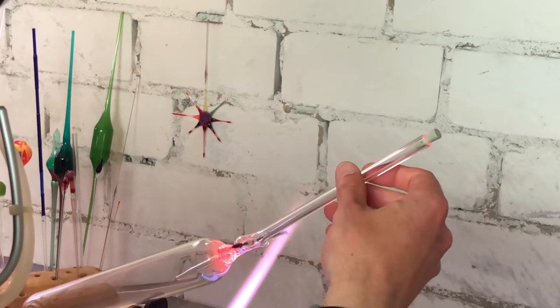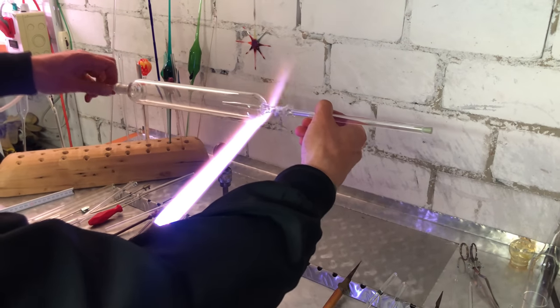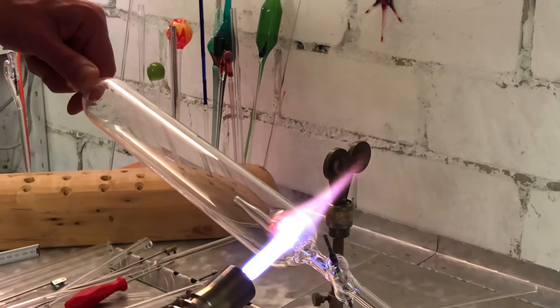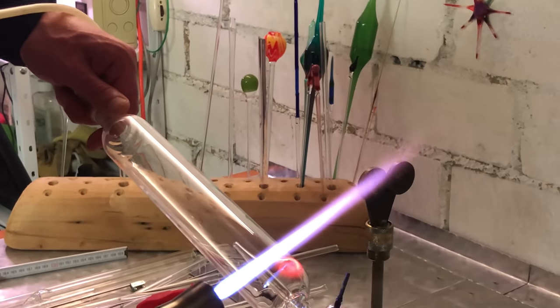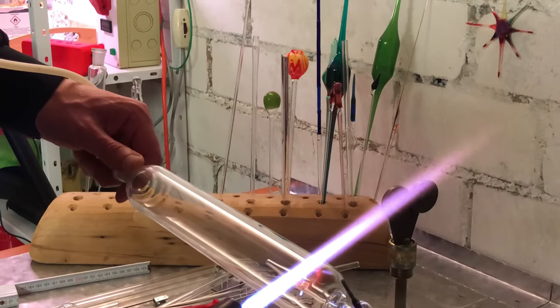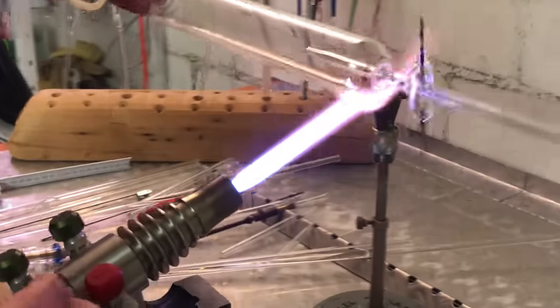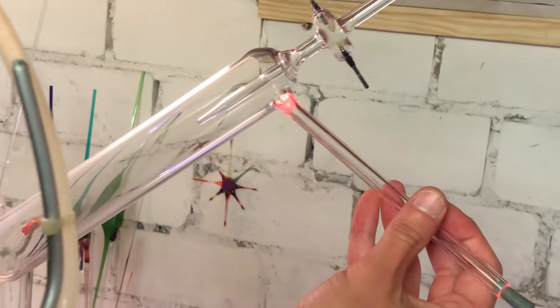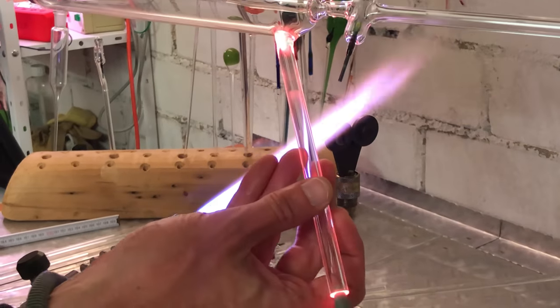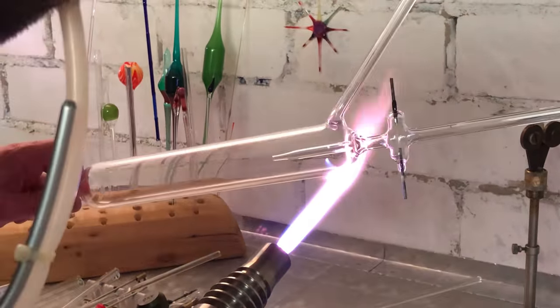It blows my mind that he is able to align the tube with the nozzle inside the large tube, just by turning it the right way while it cools down. To avoid unnecessary tension in the glass at the junction, a hole is opened without letting the glass cool down, to which a tube is attached. This tube allows the metal to flow from the reservoir back to the pump. A lump of glass is then fused to the opposite side, where a glass rod can be fused on, which will later become part of the base on which the fountain will stand.